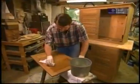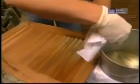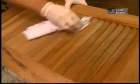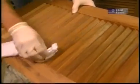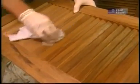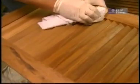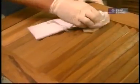For the finish on our teak, I'm using a wipe-on poly. It'll give me a satin finish. But before I put any of this on, I took the time to wipe the piece down with acetone, just as I did with the glue joints. What that does is remove the surface oil from the wood so that the polyurethane will have a good bond. I'll put on one coat, let it set for about 8 hours, and then apply another coat. And that should be all I need.